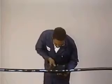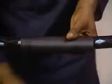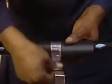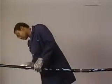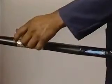Wrap the sheet back around the cable centered on the mark where the overlap will occur. Take the supplied aluminum tape and place one and one half laps around the center of the sheet to hold it in position. Smooth the tape with a blunt object. Clean and abrade six inches of cable sheath inboard of the first mark — the one opposite the point of overlap. Place one and one half laps of four inch aluminum tape around the cable with one inch inboard of the mark. Smooth the tape with a blunt object.